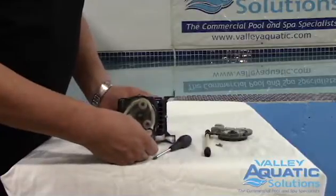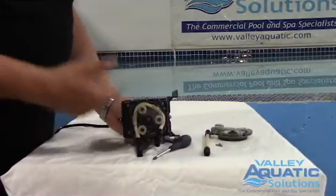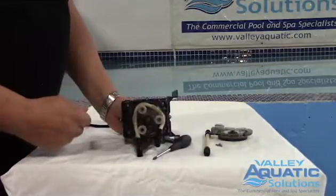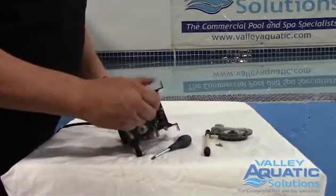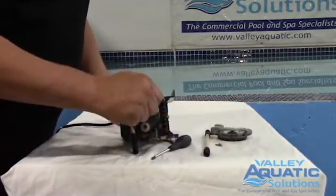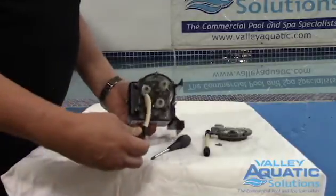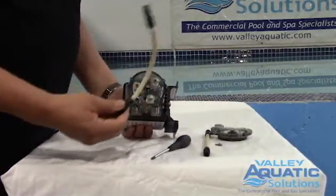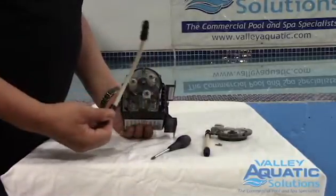There, it started. What I'm going to do is — if I just turn the pump on, the head turns too fast and I can't keep up with it as I pull out that feed tube. So what I'm going to do is jog it. See that? And get it out. Now I can totally remove the feed tube. Now I'm going to install the new one.